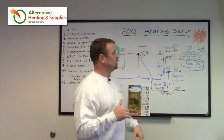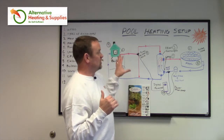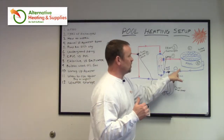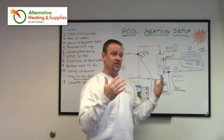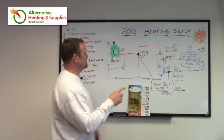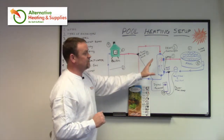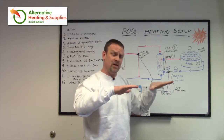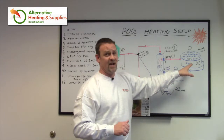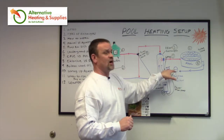When you close up at night, put that solar cover back on and turn off the filter. The reason you lose so much heat at night is that circulating water creates turbulence on the surface, and that turbulence is a transfer of heat — it swaps heat faster with the colder outside air. When I was running the heater all night, I was gaining zero degrees while burning wood all night, making zero gain. When I turned off the heating system and covered the pool with a solar heat blanket, I lost no temperature. So I saved a lot of wood, electricity, and effort. Turn it off at night, put your solar cover on, and during daylight hours keep the cover on if you're not swimming and run your filter for heat exchange.